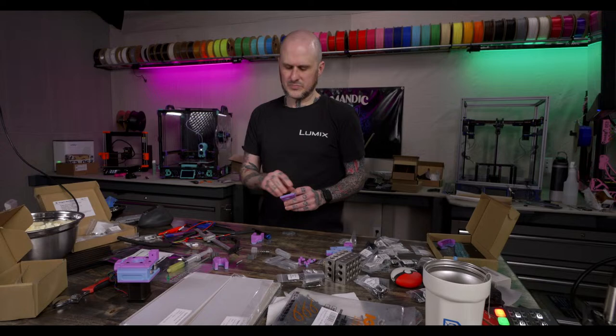Looks like my Mercury 1 looks good. Have you hung the display mount anywhere for it? You mean have I posted the display mount somewhere? No, I never posted the display mount. I wasn't sure if anybody would want it. And I don't know how well it would fit your V-Core, since the V-Core uses 3030 extrusions, right? It was designed around 2020 extrusions. Well, 2040. If folks want me to release the design files, I will.